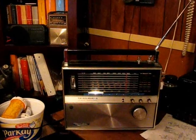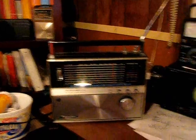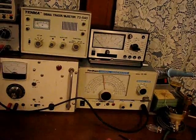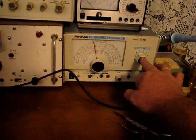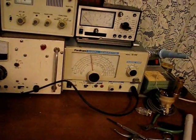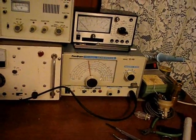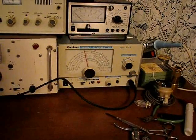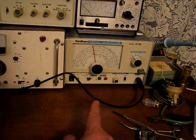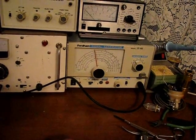So to be able to get the sideband on this, what I have done is preset my signal generator up to the 455 frequency. It's set for band B, and band B right there is a tick for 455 kilohertz. I don't have any kind of modulated tone — it's just a carrier that will be sent out.